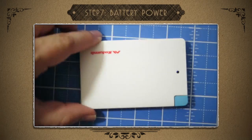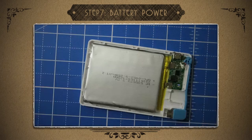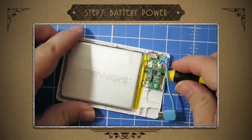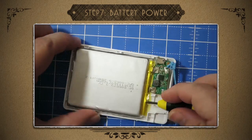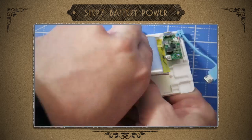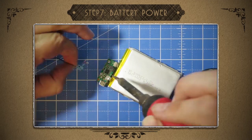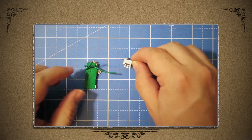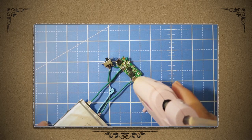To make this whole radio portable, I'm using a 2500mAh power bank that's normally used to charge cell phones. Being very careful with the highly flammable lithium polymer battery, I took the case apart and then desoldered the USB board and USB connector to extend the wires. I also added a side switch to turn it off and on.